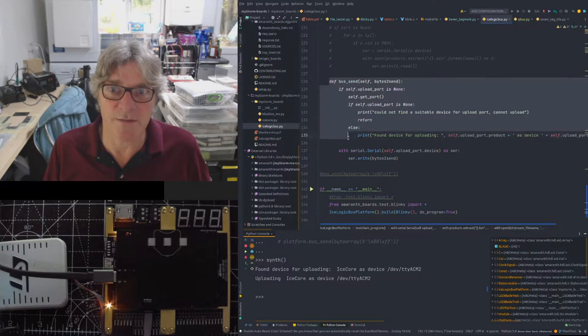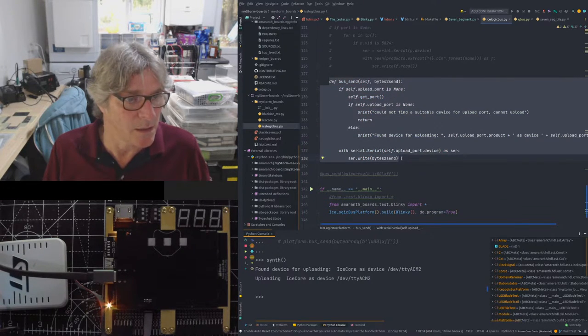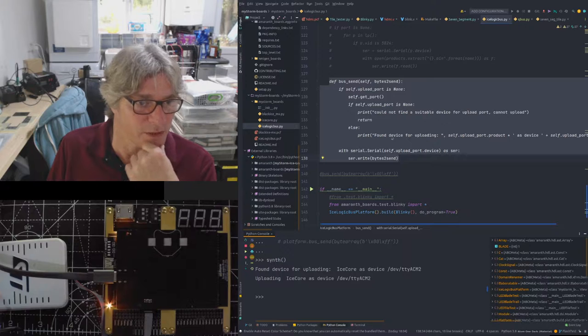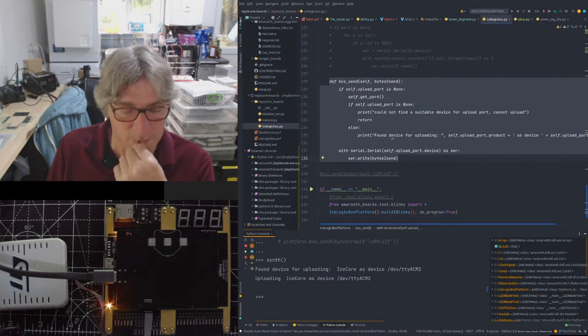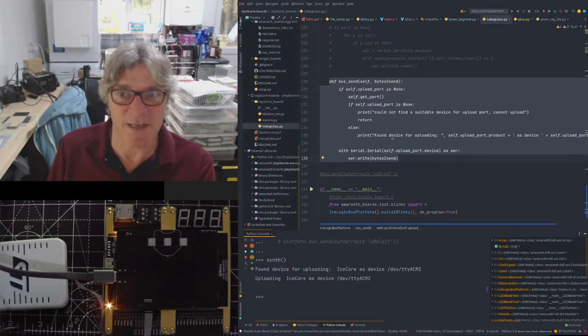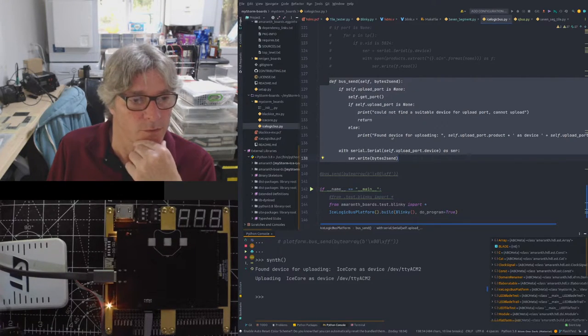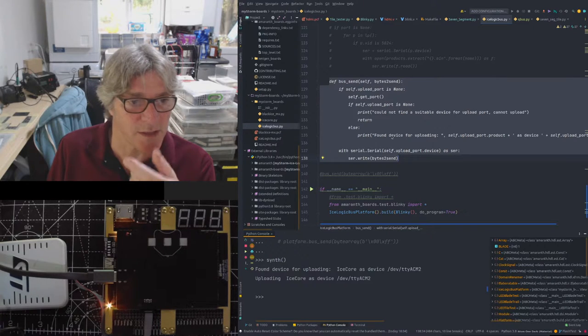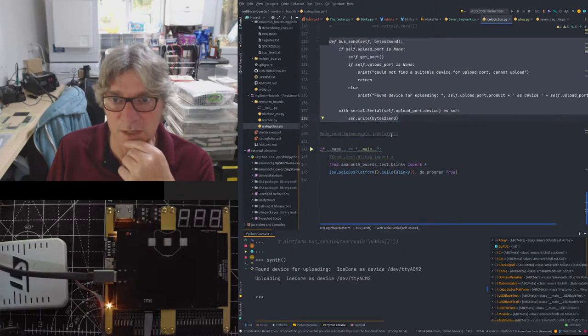This other convenience function here is so that we can send data over USB to the Black Crab firmware. That can then do all sorts of different things, depending whether it's passing the information to the local firmware, Black Crab, or whether Black Crab itself is in turn passing this onto whatever is synthesized in the ICE40 over the QSPI channel. So we could then remotely start manipulating a bus that exists inside the synthesized ICE40 image that's running.